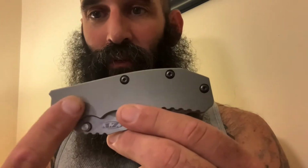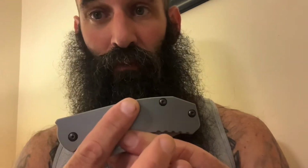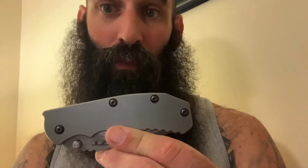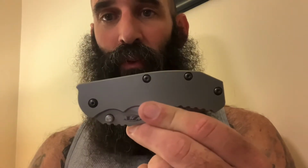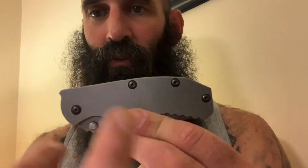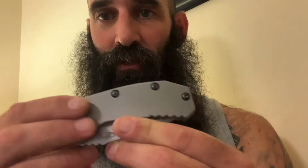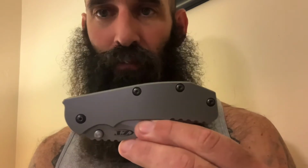At that point, I located the pins again, put the 2 screws in here to hold it to the fixture plate, pulled these pins out, and put the other screws in, for a total of 4 screws. At that point, we're going to rough the profile, so I went around the whole thing with a 3/8 end mill, roughing it all in. Then I took an 1/8 inch, because that 3/8 ain't going to get into these grooves right here, and profiled the whole thing with the 1/8 inch. Easy peasy.